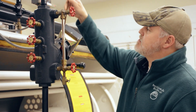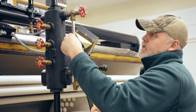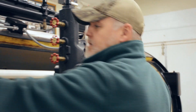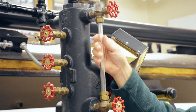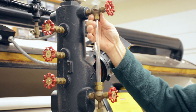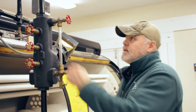What we're checking here is the vertical reference of your inlet to your outlet on your gauge glass — and if you think of it like a plumb bob, that's the best description I can give you. If you have one that's prone to leaking, it could be that there's some cant on your gauge glass, causing the rubber washers and gaskets in there to be a little bit jacked.